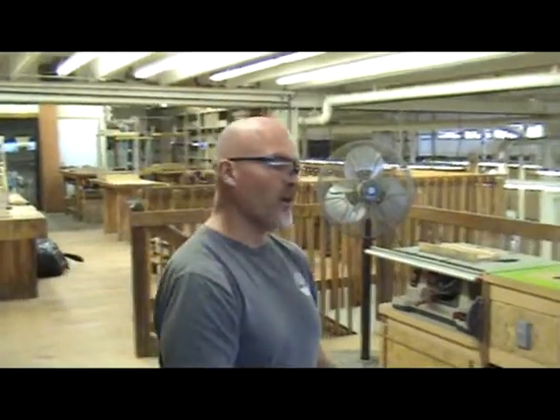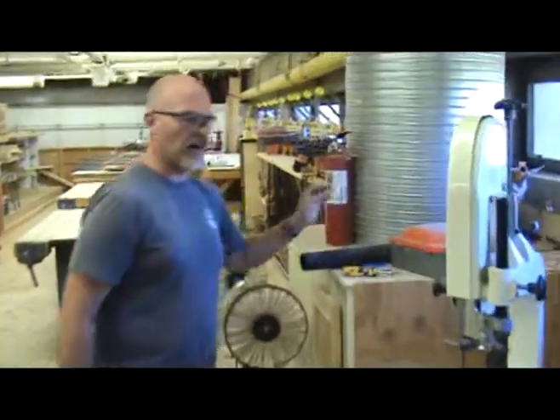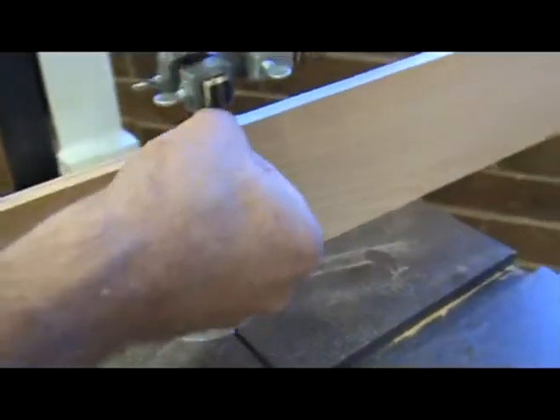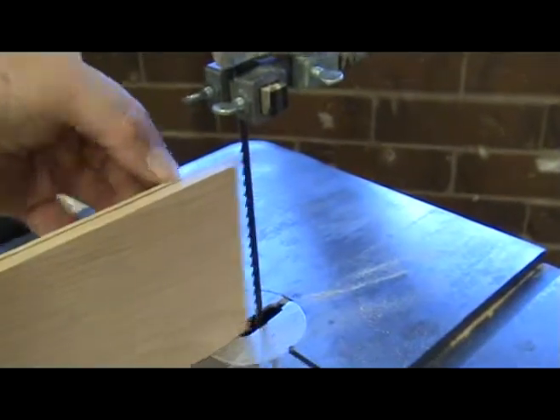For anyone paying attention: I wouldn't grab your $300 piece of rosewood the first time you ever do this. I would experiment with a piece of maple or oak — something relatively hard. If you practice with poplar and then try it with rosewood and wonder what happened, well, rosewood is a lot harder. Maple or oak would cost a lot less money to learn on. I like to have between a half inch and an inch of clearance on the guide height — it helps me guide my cut — but we're going to lower it just a little bit from a safety standpoint.